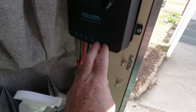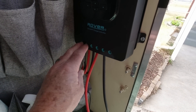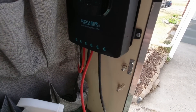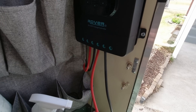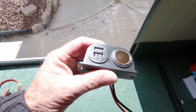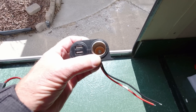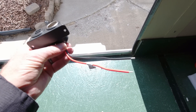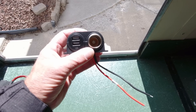This MPPT controller has a load terminal — I don't see very many people talking about this. You've got two terminals for power in from the panel, two terminals for power out to the battery, and two terminals marked 'load.' What that is is a connection between the solar panel and whatever appliance you want to run without running it through the battery first. Today I'm going to put on those load terminals a USB charging port with a cigarette lighter port, since a lot of our things run off a cigarette lighter plug. This will go directly to those load terminals on the Renogy MPPT controller.